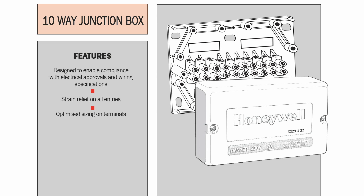After all the items have been installed, all of the cables are taken back to a single point and connected into what's normally called a wiring centre. In reality this is just a plastic box with a row of screw terminals inside, with cable entries around the sides and some means of securing the cables. This example from Honeywell has 10 terminals, which is more than plenty for the S-Plan wiring system.